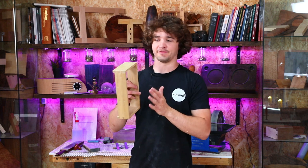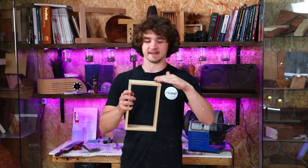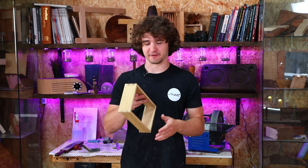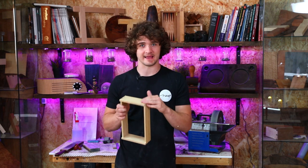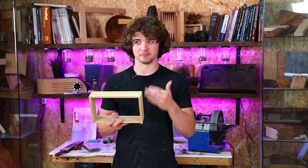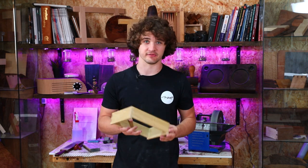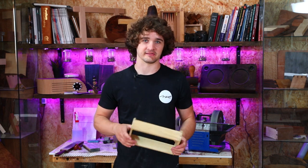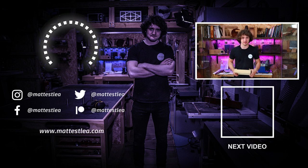And what that leaves you with is a box with a perfectly flat face, flat sides, and flushed off joinery, ready to move on to the next stage. To reiterate: when planing down the faces, don't plane off the opposite end or you'll break out the end grain in frustration — work to halfway. If you need to hide small gaps, plane the end grain in the direction of the gap so it breaks out to fill it, and put a little dab of glue in there to make sure it holds. When flushing off the joinery, make sure to bring the entire face down flat and level, and ensure there's no rock in the bottom after assembly. Click the link below for the next lesson, and please subscribe.